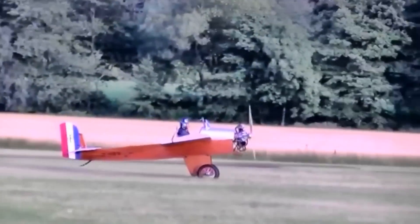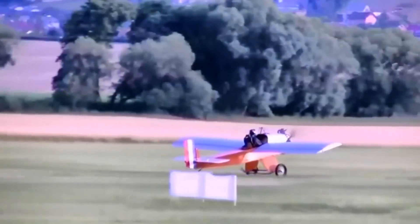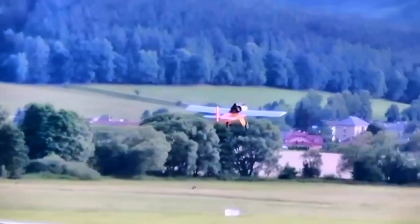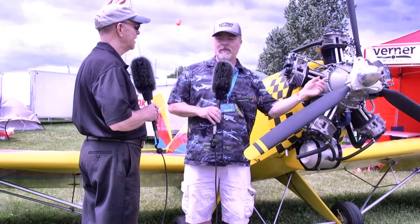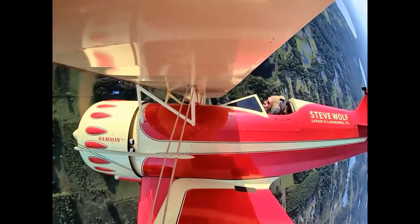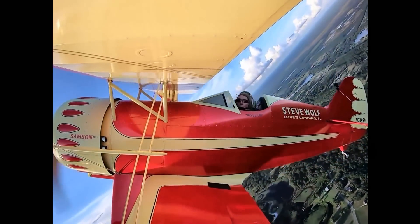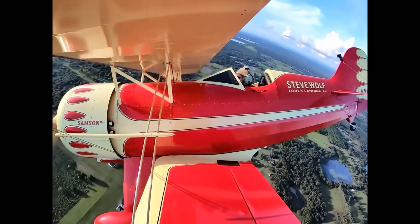It's an old-looking engine, but it's actually quite a modern engine. They've tried to stay with a classic radial design — all the internal components are made exactly the way you would with an old Wright engine or a Jacobs. But they use modern elements: electronic ignition, a built-in alternator, fuel injection, a single coil for every spark plug with separate circuits — so it's very redundant. Modern materials including magnesium. Looks old, is new.